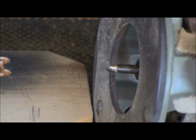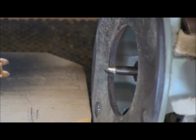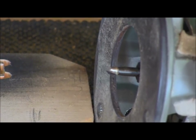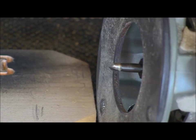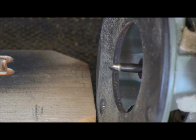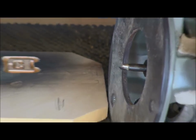So again, to reiterate, when you're doing heavier cuts, like the background around outset letters, or even the scalloping, or heavy chamfering, I use a bigger router. I only use the little compacts for the outset letters and inset letters. And then also this router or the 690LR for cutting the shapes that take those template guides, with that other base in it, because this is a base made for just being able to see what you're doing there.